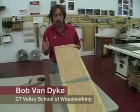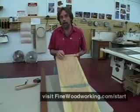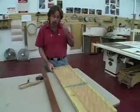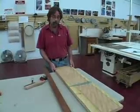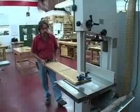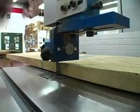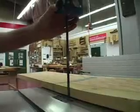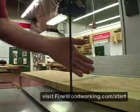The first thing I'm going to do is go to the bandsaw and cut this off. The reason I need the bandsaw is that it does not depend on having any straight edges or any flat faces. I can't do this on the table saw safely because there's nothing flat or straight to run against the table saw fence or the table. I've marked this line and I'm going to cut through here, freehand, staying roughly on the line. Set the bottom of the guide about a quarter of an inch above the thickness of the stock — that gives you a better quality cut and more blade support.